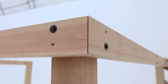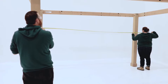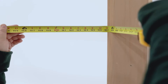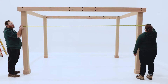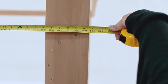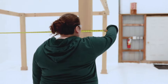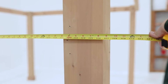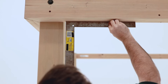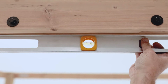When the frame is fully assembled, check to make sure all the measurements on page 19 of your instruction manual are met. It should measure 13 feet 11 inches diagonally between posts. At the front and back, along the sides of the assembly, it should measure 11 feet 8.5 inches from outside to outside of the posts. The shorter sides of the assembly should measure 9 feet 8.5 inches from the outer edge of each post. Take some time to make sure the post assemblies are square to the beam assemblies and the beam assemblies are level.